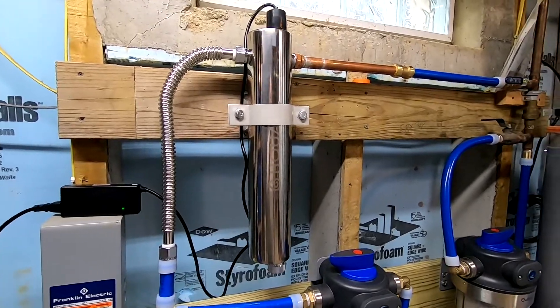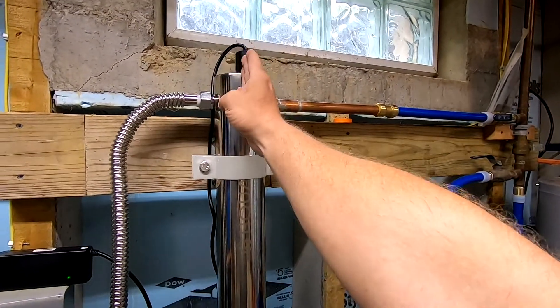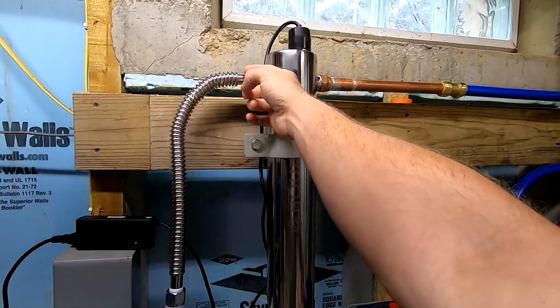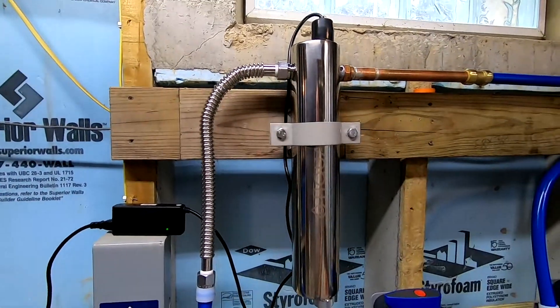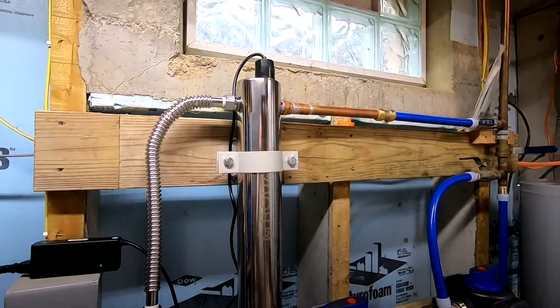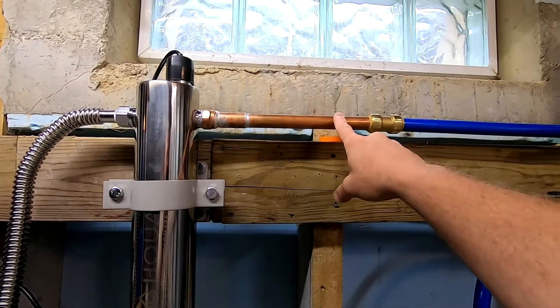In a vertical system like this, where the water comes in on this side, there's actually a stainless steel piece that runs all the way through, and there's actually no UV light exposure on that side. So even though I use stainless to illustrate this, you could actually plumb PEX right up into this side of it. But that just depends on the type of UV system you install. This is the side where the bulb is — that's why we have copper right here.